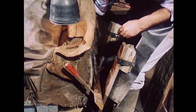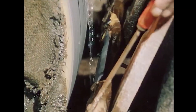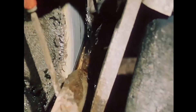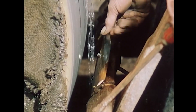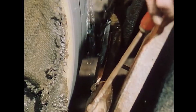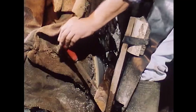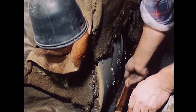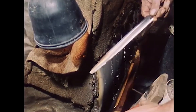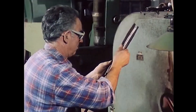In the Ehlis file factory, the stone is driven by an electric motor, with power generated by a water turbine and generator at the time of filming. Before grinding, the file is inserted into a grinding wood, with the appropriate type selected depending on the file. The half-round files are then sanded on the machine, where cross-arranged sanding belts provide the desired matte surface.